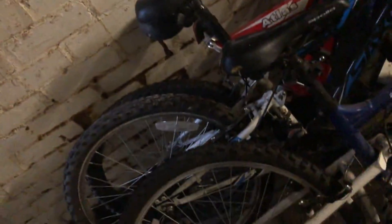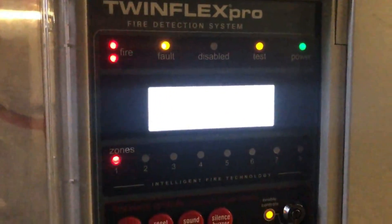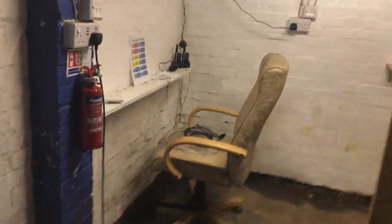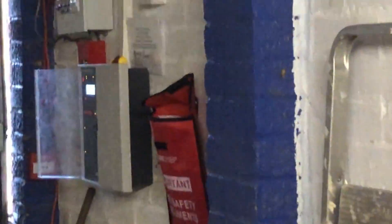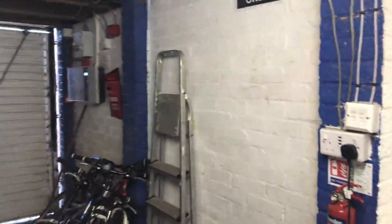We'll start with this call point here. I'm going to activate one with a test kit - not this wire, it's so annoying, it's only temporary. I'll do this one with a test kit and the other one by pushing it. Stick the test kit in - it's received it. There's going to be a reset. Let's go and do zone two which I'll push. I think I reset it in time - yes I did.